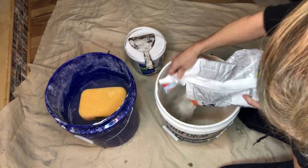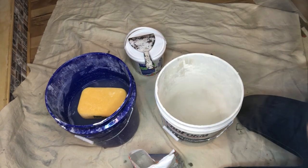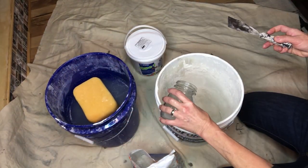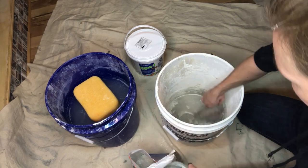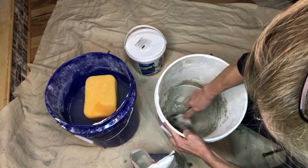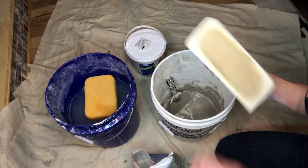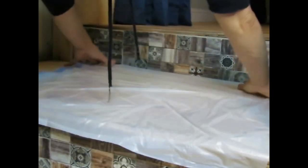The adhesive is dry and the tile is ready to grout. I like mixing the grout a little bit at a time, and a little bit goes a long way. You might want to wear a mask — things can get a little dusty. I've got about a cup or two of grout in the bucket. I'm adding some water a little bit at a time and stirring until I get the consistency I'm looking for — almost a thick cream cheese kind of consistency. If your grout is too thin it will just run out of all the crevices; if it's too thick it'll set up quick. Now it's time to bust out the rubber grout float. I'm putting down a garbage bag to protect some of the surrounding areas because this gets messy.